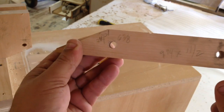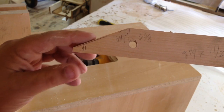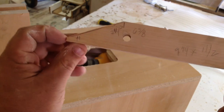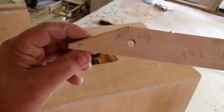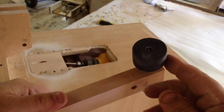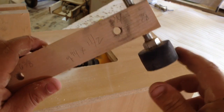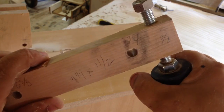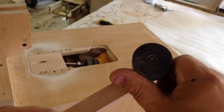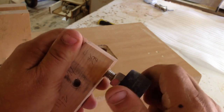We're going to cut an angle on this stick. Measure back two and a quarter inches and leave about a quarter of an inch, then just cut that angle off like I have right here. For the clamp part, this little rubber piece on the end is actually a hockey puck — I took a hole saw and cut a piece about an inch and a half around, then drilled a slightly bigger hole and threaded a bolt right into the hockey puck.